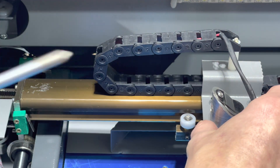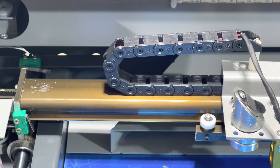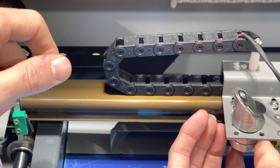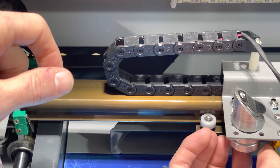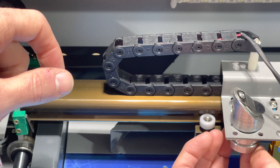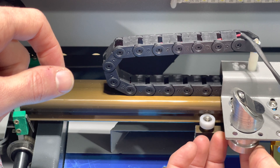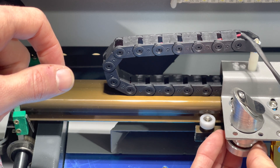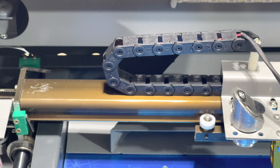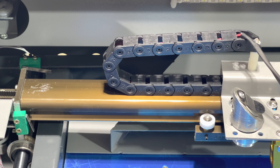Next we need to loosen the laser head from the gantry — just grab hold of the bottom, it may be a little tight. There are a couple of pieces: the section where the little lens sits. Since it was unscrewing for me I went ahead and removed it. Be careful when you pull this out — this is our little lens. When you replace the lens, make sure the convex side — the part that's bulging out — is sticking up, and the concave side is pointing down.